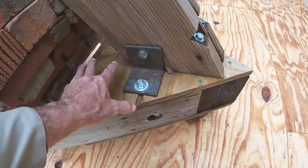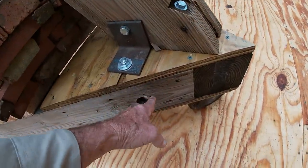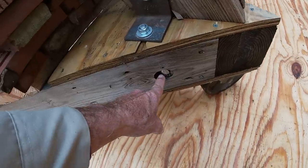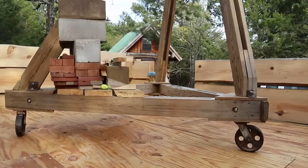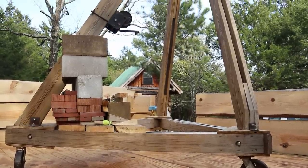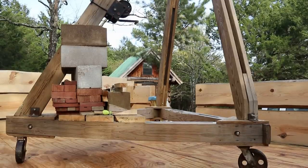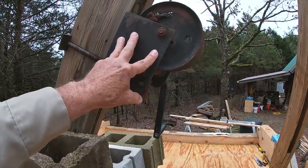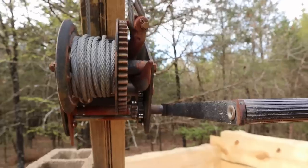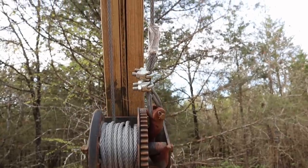This back corner is really secured together well. There are two long lag bolts that go down through at an angle into the back corner, and then another bolt that goes all the way through to hold it together. I've got enough counterbalance mounted up here — just some boards across with bricks, blocks, and whatever I had to put enough weight on the back for counterbalance. I'm using a 3,200-pound winch, two-speed, with 50 feet of 10,000-pound tensile-strength aircraft cable.